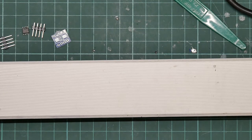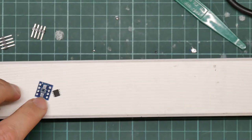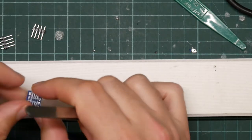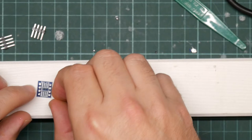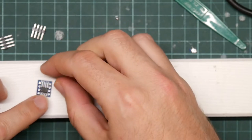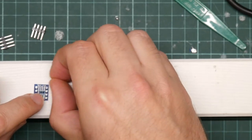Alright. So, what I'm going to do is to solder the chip onto this adapter board. In fact, the pin spacing is incorrect on this side. Good, it's got the right spacing in this side. So I'm going to solder the chip onto this adapter board by placing it approximately here. I haven't actually done this before. I'm going to use the hot air gun for that.